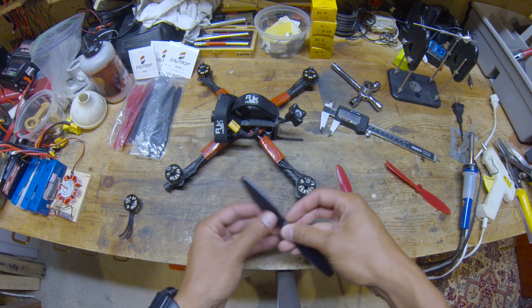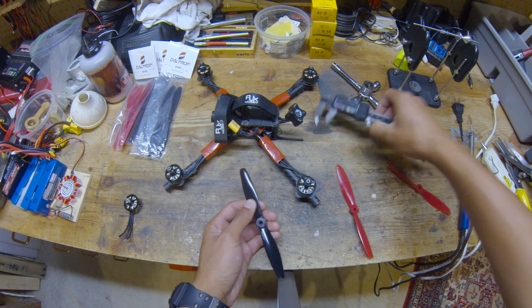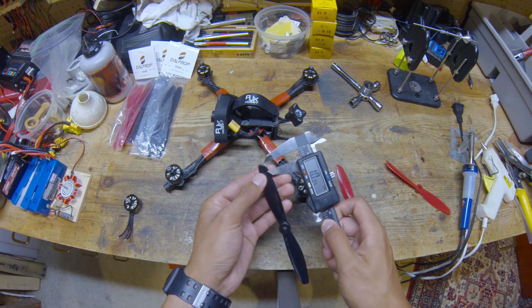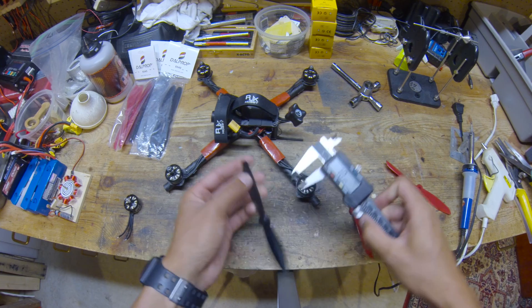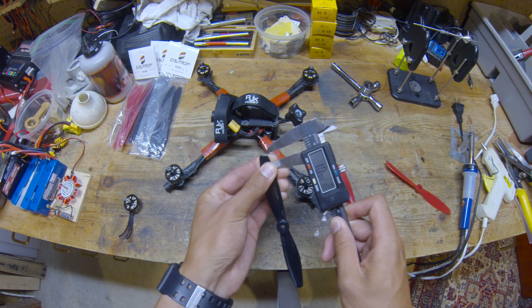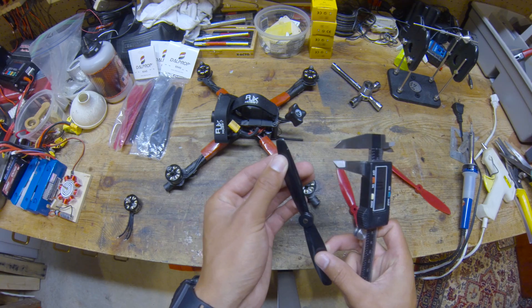The way I do this — and I have done this before on other props — is I'm going to measure and just score a point a certain amount down on the leading edge of the prop. I've picked about 10 millimeters, so I'm just going to measure from the tip of the prop inward on the leading edge and score it. You probably can't see it, but I just have a little score mark.